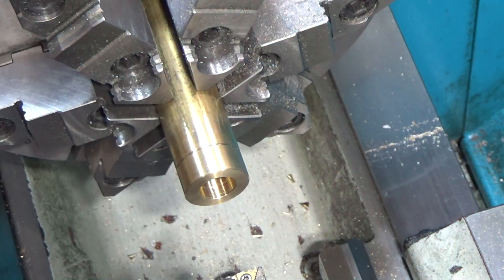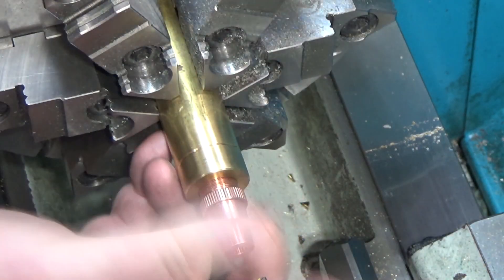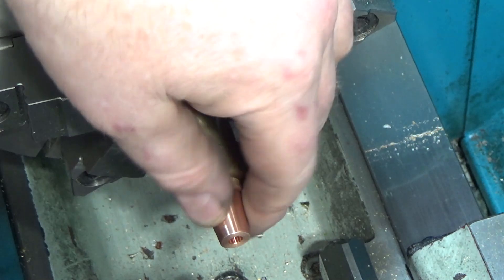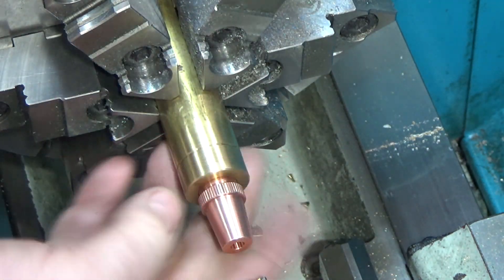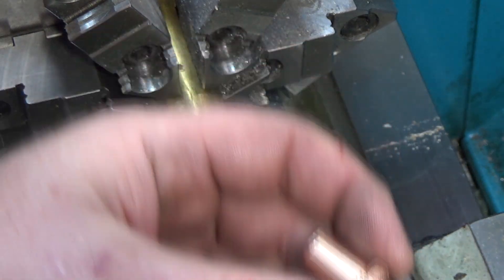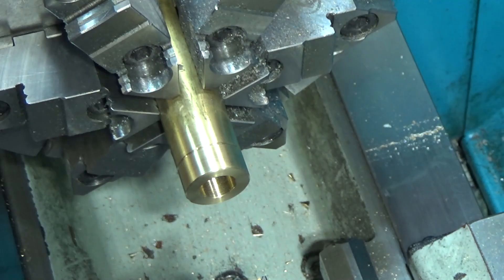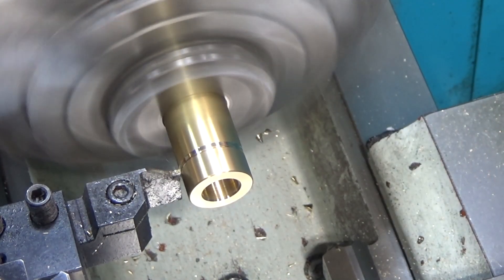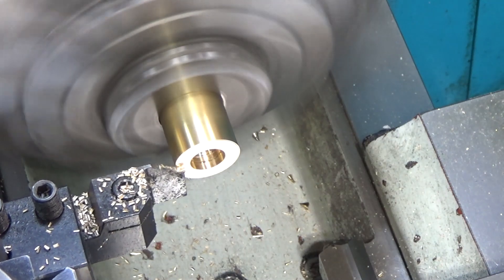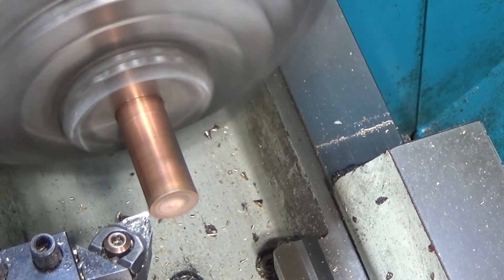These are soft jaw pliers - very handy to have. That's much better, beautiful! All right, ready to part this guy off. We now have a thread gauge. All of this was so that I could test the threads I'm going to make. Next up I'm going to part this off now that the thread gauge is done, and then we're going to make the actual piece - except without the taper, and as large an internal diameter as I can get. Got to love brass.